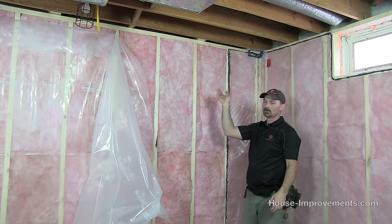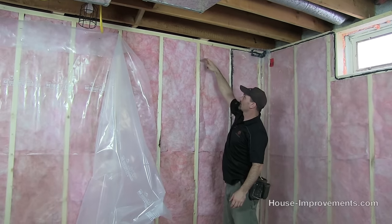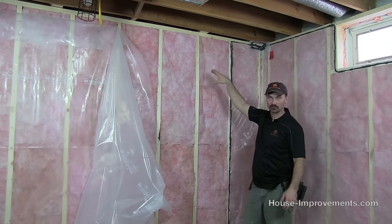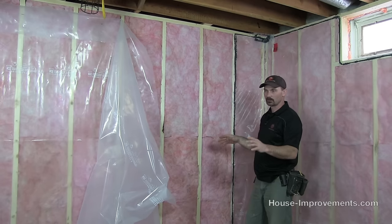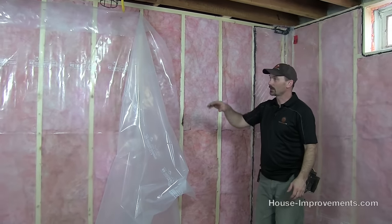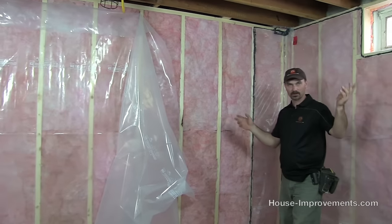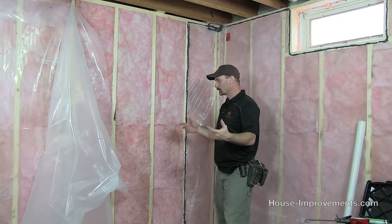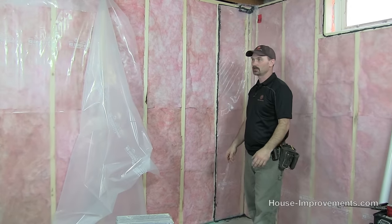Normally I would do my walls and then install the ceiling right over to the corner, let it come down, and seal it to the wall work that's already done. Really it's just like dealing with the wall except that you're working over your head. We've gone ahead and cut the poly to length. Normally I would just roll the roll out, lean it on the wall, and try to do it as continuous as I can, but for this demonstration I've cut a smaller piece so that you can see.